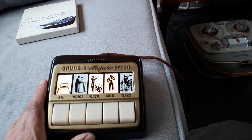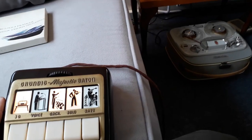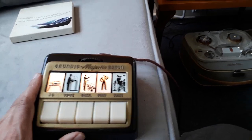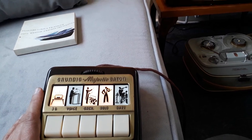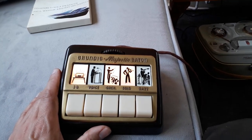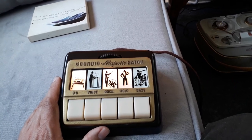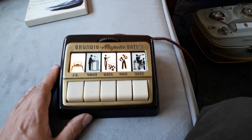Thankfully the break was at the plug end on the set, so I could just cut an inch off and that cured that problem. Then there was a shorted resistor to one of the ground leads, which killed the sound. With the help of John we diagnosed that and managed to push that out of the way. There was also a piece of metal shorting to ground — I don't know how that happened — but that was another fault that was spotted, and then I managed to get it working.